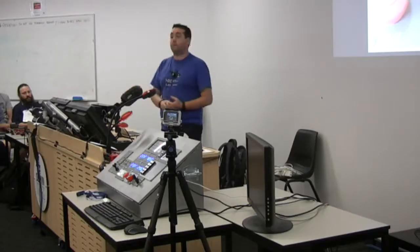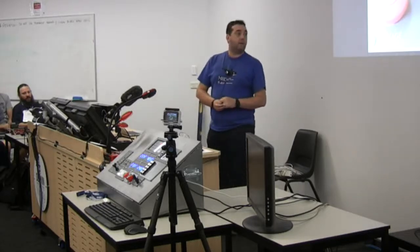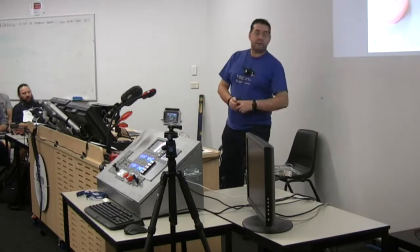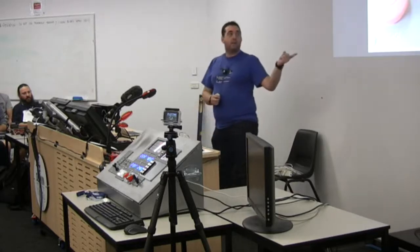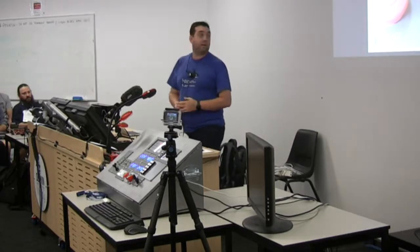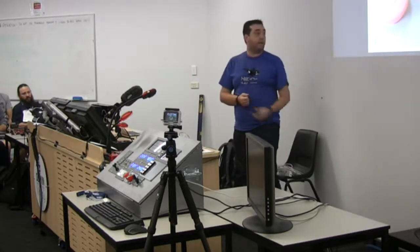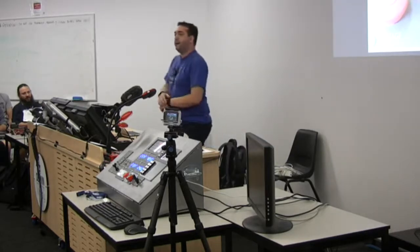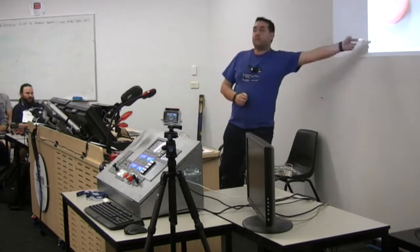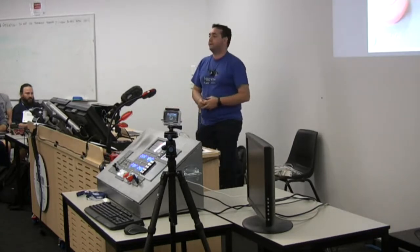There's a dozen of these panels and they're literally spread over several months. I documented absolutely every step of what I was doing. Somewhere in my repository there's a text file with everything related to building one of these panels - how I prepared them. That's 3mm perspex, translucent perspex that has been painted, etched, and cut in a laser cutter. I've got documentation about fonts and font sizes, mounting holes and how big they should be, the radius on the fillet - all written down. I've got panels I built 15 months after this one, and I could spend five minutes reading my documentation and punch out something in an afternoon that looks identical.